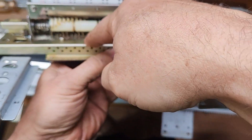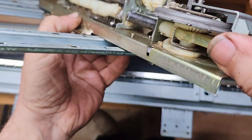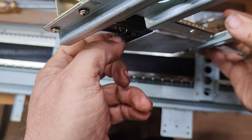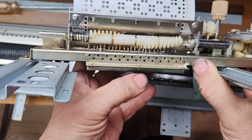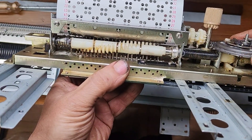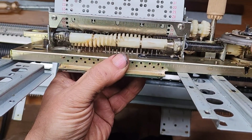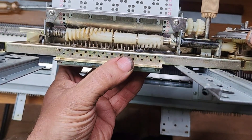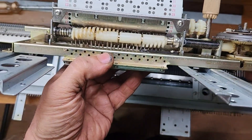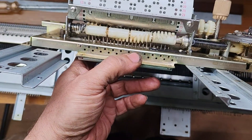For this next bit, we have to pay attention to these little pieces of metal here, which you can see poking up. They are in fact U-shaped pins. If I turn it to the end, you can see it's a U-shaped pin — one end comes up at the front and one end comes up at the back. You can see the pins poking out at the back, and when I change direction, you can see that the pins are pulled down, the card advances, and then the pins go back up again. If there is a hole in the card, the pins can go all the way up through the hole and sit slightly higher. If there's not a hole in the card, the pins sit slightly lower. So we've got some pins sitting higher and some pins sitting lower — that's the beginning of our pattern.